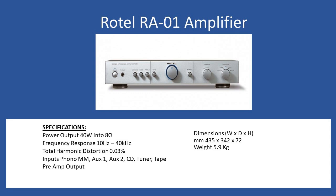There is also a pre-amplifier output connection, so if you want to connect that to additional amplifiers you can, and that output signal is one volt max. Dimensions are 435 by 72 by 342. It has a headphone socket on the front, and you can also do tone defeat. Another nice feature is dual speaker outputs — you can select from the front to turn speakers off, and choose A, B, or both.